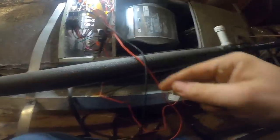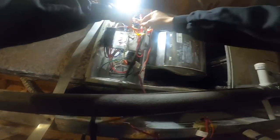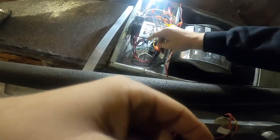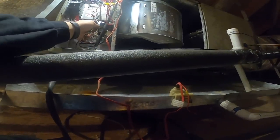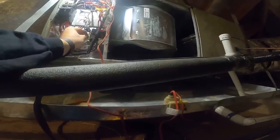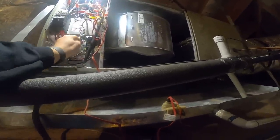All 10KW is on. I can check all these wire nuts, make sure they're tight. Make sure the fuse is tight. Make sure these plugs are tight. I want to ohm out that contactor coil, but I want to be careful because if you pull too hard on these, they like to break on these Trane units.